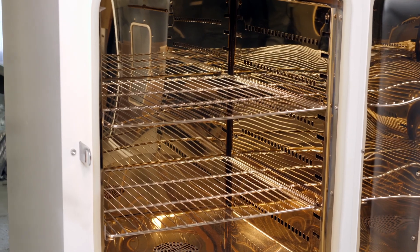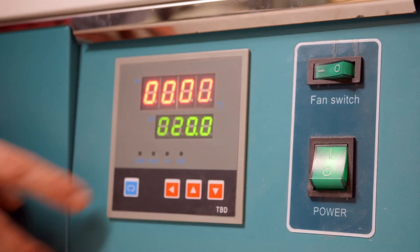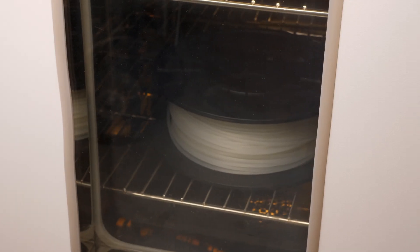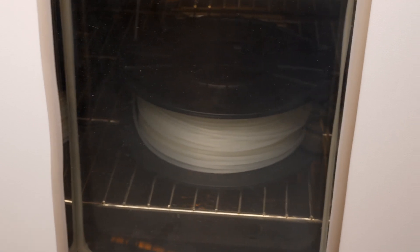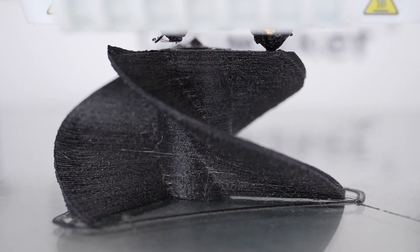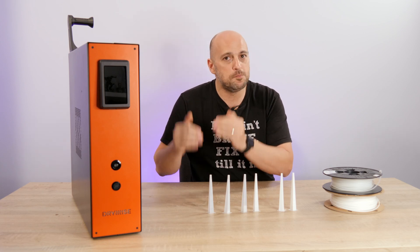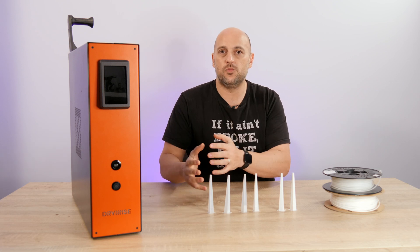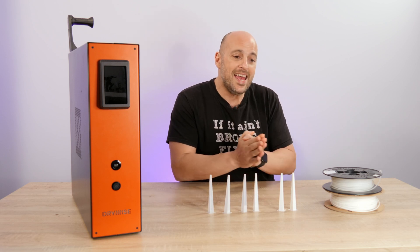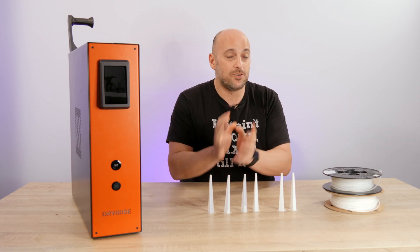On the commercial side, if you have a large company specializing in 3D printing, prototyping, and manufacturing, your solution will not be a homemade dehydrating spool. Chances are these companies spend tens of thousands of euros on industrial ovens, with spools stacked up for hours on end. Especially with 2.85mm filament, it can take tens of hours to dry. Even brand new spools can already have moisture in them, and in a company, time is money — waiting 10 to 20 hours for filament to dry is costly.